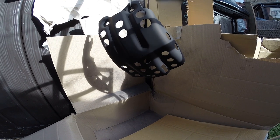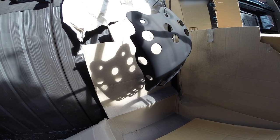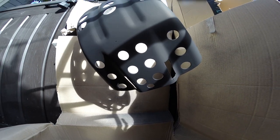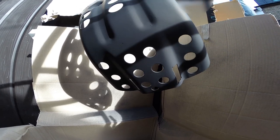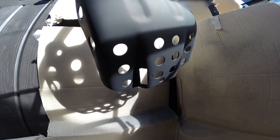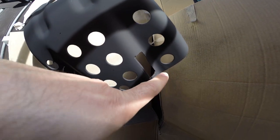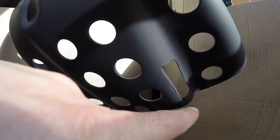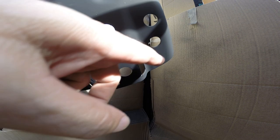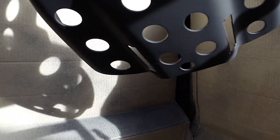Here's my homemade backyard spray booth made with Amazon boxes. I've finished grinding the access holes for the engine guards to fit through and did a little rudimentary filing on them. Now I'm spraying them with some high-temp, heat-resistant, durable overcoat. I ended up using a Dremel-style tool to do the short cuts across the top and bottom — the cutting wheel on my grinder was too long. I was able to do the long cuts but the short cuts meant I was catching either side of the curved section of the plate, so I used a bunch of smaller cutting wheels and was very patient. Perfect size to cut what I needed.